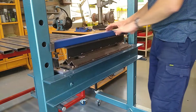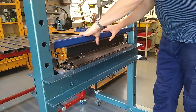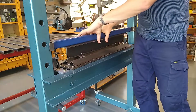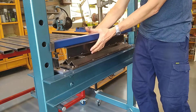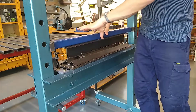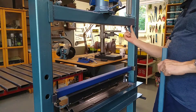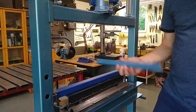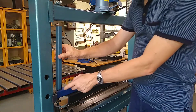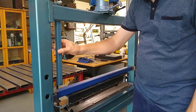So that's the new beam fabricated. You'll see it's a lot smaller than the beam that the jack sits on — I'm just trying to keep the profile of the punch assembly as small as possible so I can bend smaller radius sections. I'm going to make up a bit of flat bar that bolts to the bottom of this beam, and to that I'm going to weld a bit of 25mm square section which will then be acting on this. It will be fastened with a pin so it can be removed.